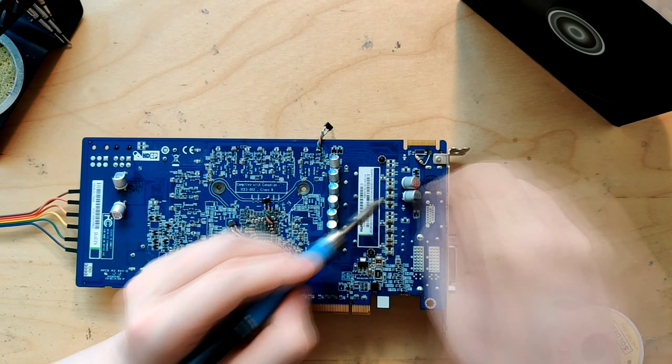one thing that I can also say is that the input capacitors I put on actually did something. While I was testing around with the card, wondering why it was shutting down, I thought it might be hitting over current protection from the inrush current of the capacitors, so I removed all the output ones. That's when the card worked again. While testing, I just had the oscilloscope hooked up to it. I think I left these two that are on the anti-pads on, but everything else went off the card. But just with these two caps, and then the input caps, this already went down to like 155, 160 peak-to-peak on V-Core. I don't remember what the undershoot was like, but from 185 to 160, that's already a decent improvement.